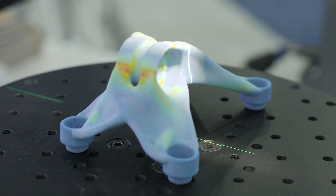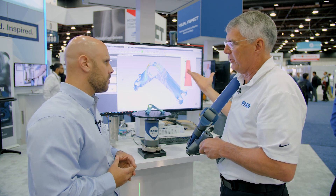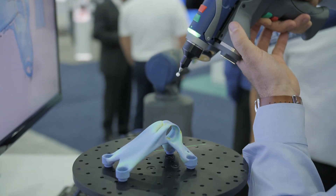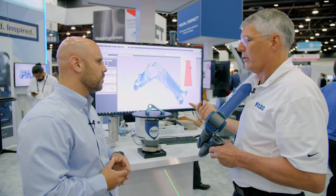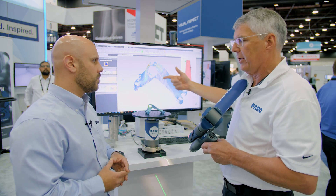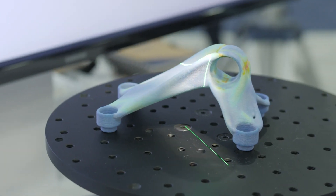Once I've collected enough information, I can do things like feature extraction in this software. We use Geomagic softwares primarily with this scan arm, but it does plug into a number of them — it has a USB cable that just plugs into a computer. We use Geomagic Wrap right now; that's if you're just trying to create a shape, mesh it, and do a surface at the end. We also have Geomagic Design X — if you want to create a parametric design model, it can transfer into SOLIDWORKS, Inventor, Creo, and other softwares. Then we also have Control X. So if you've 3D printed a part and you want to check the tolerance on it, you can load the CAD model into the software, take a scan, do an alignment, and then do a color map just to see if it's within tolerance or not. These are our three primary softwares, and all of them work with our Design Scan Arm.